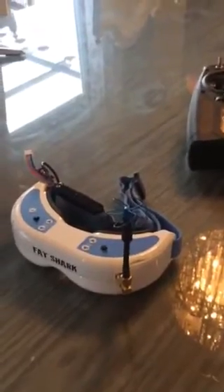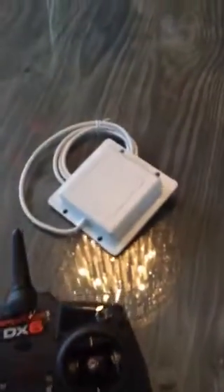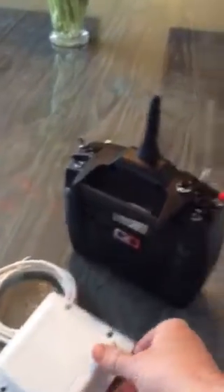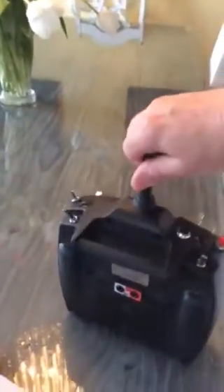Stock for now is a DX6, and I've since purchased an 8 dBi panel or patch antenna from Ready Made RC that will be installed. I've also ordered some pigtails with SMA connectors that I'll be replacing the stock antenna with — I'll be cutting it off and having an SMA female poking out, and the pigtail with a UFL connection will go onto the internal transmitter.